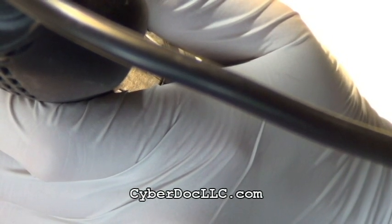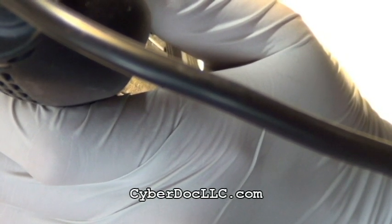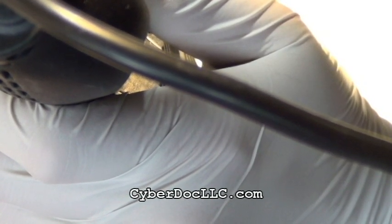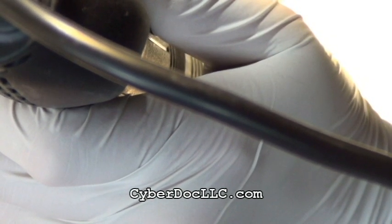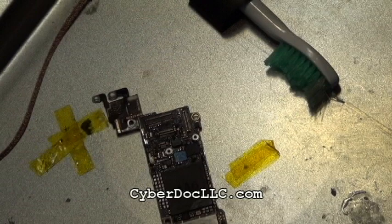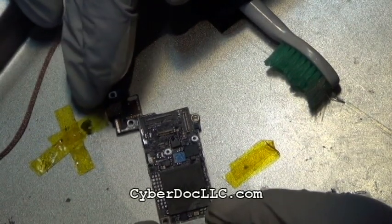You don't really need to heat up that long. In the video it's just for demonstrative purposes, so I heat up a long time. But in reality, when you actually do this without getting recorded all the time, you can heat it up at high temperature right away and get it done. Right now, I'm really just taking the advantage of heating it long, because you get all the solder molten and in liquid form. Hence, you get a much better bonding.